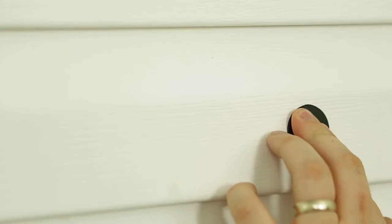To use, drill a hole through your insulation wall. Hammer the bushing into the hole you created. Route the cables with the proper bend radius through the bushing.